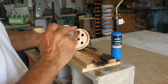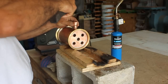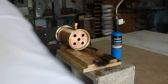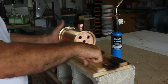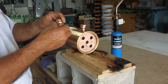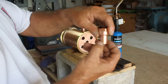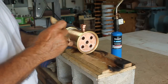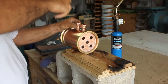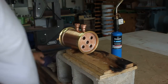The reason I had you guys cut that three-quarters is, when I go to put this on here — when I put those in, there's a little shoulder that separates the body section from the top of that. So it gives me a little bit of space right here. So when I fill this with solder, it actually has a reservoir to go around, and it actually holds it a lot better. I found that just drilling it big and trying to stick that in there just doesn't give you the connection that I like. So I'm giving you the heads up on that — it works a lot better that way.